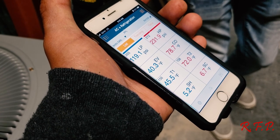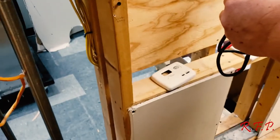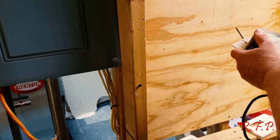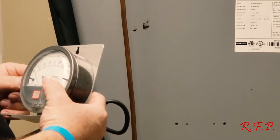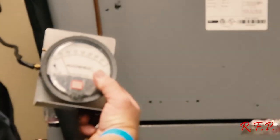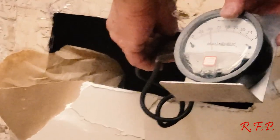It's going down. It's 63 degrees in the house. You're not going to maintain a 40 degree evaporator when you're trying to get 43 degree air out of it. That would be negative pressure. Let's watch what happens when it goes across the coil now. I was up under there with a 0.2 negative. And this side right here will be the fan after it goes through the coil. Look there where it went to.